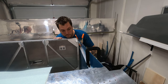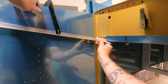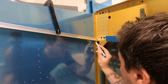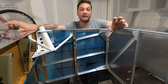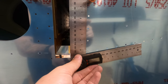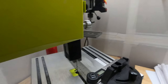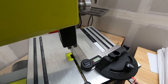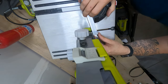It doesn't take much twist, and it also doesn't take much clamp. Now we just gotta cut the angle on the aft end to get it to fit in here perfect. I took more off the back end than I actually thought I'd have to. So much, in fact, that I had to reference the instructions and the plans about 50 times to make sure something wasn't lined up incorrectly. Rather than filing, as the instructions say, I wound up matching that angle and taking it over to the bandsaw. If I had filed, I think I'd still be here to this day.